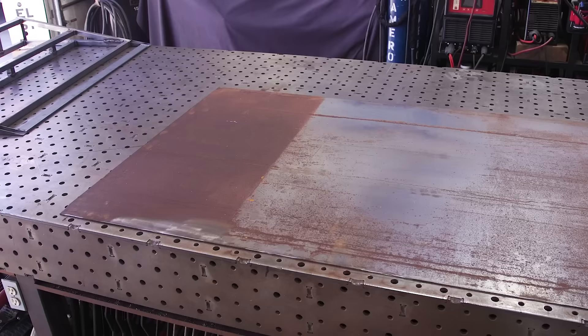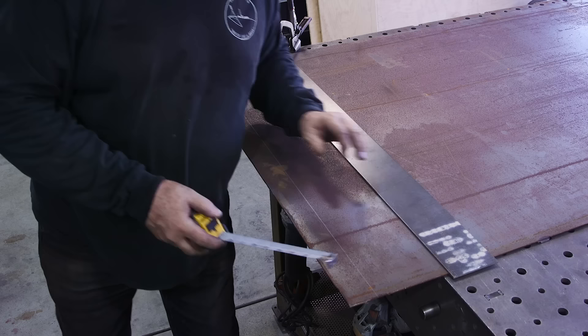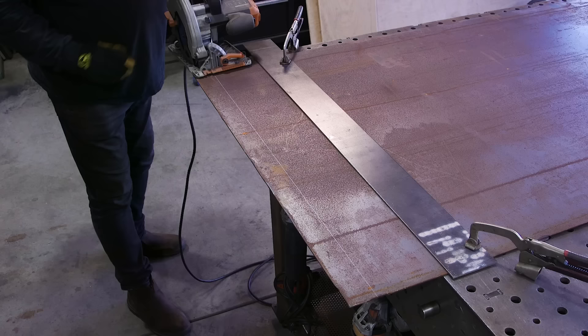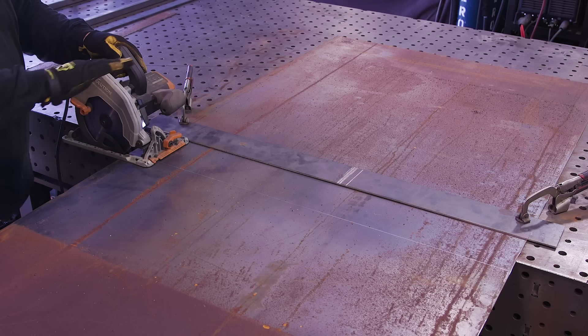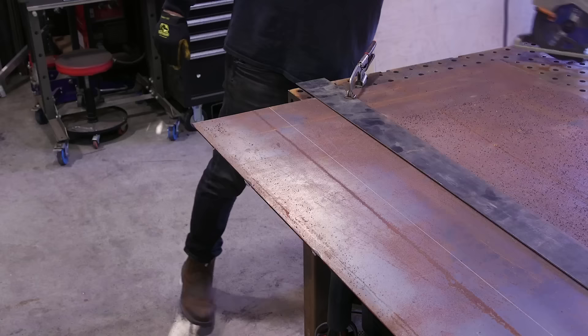Here's the sheet metal we're going to use. An interesting note — you can see how rusted this piece is. It had only been sitting outside for a month or so, but what happened was I had a bucket with muriatic acid in it about 10 feet away, trying to remove mill scale from some small pieces. The flash rust from the muriatic acid fumes alone was enough to do that much damage to this sheet metal. Just amazing how strong muriatic acid is.